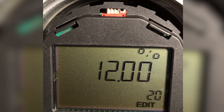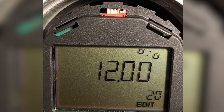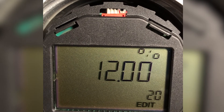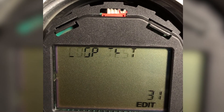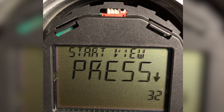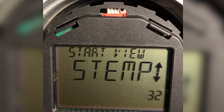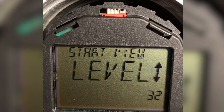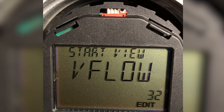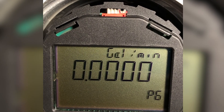The next thing I have to do is assure myself that the initial start view of the transmitter — when it's normally reading what it's supposed to read — will be flow. So I'm going to do that in the start view parameter, which is parameter 31. Factory reset is pressure — I don't want pressure. I want volumetric flow. Edit flashes so I know I'm doing something. I don't want temperature of the electronics or the sensor, I don't want level — I want volumetric flow. There it is. I hit enter and that's entered. Now when I press the left-hand button to get back to normal display, you'll see it says volumetric flow in gallons per minute. It's that simple.